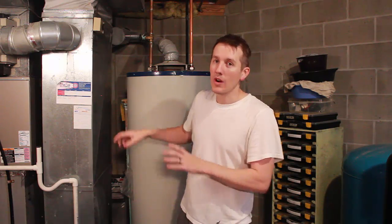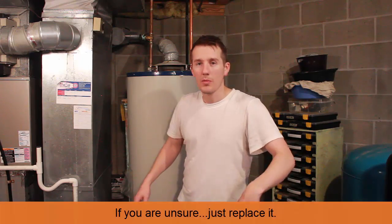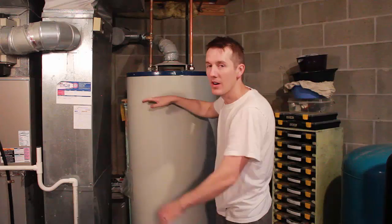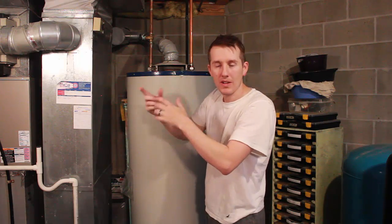And if anything is wrong, I do recommend replacing it. It's not the end of the world to replace it. You just turn off the water, turn off the gas, drain it to about here, loosen it up, put on some Teflon tape and put the new one on. That's not the end of the world.